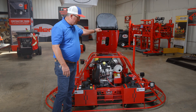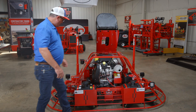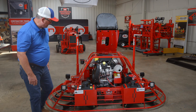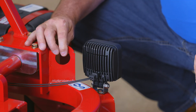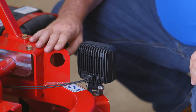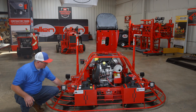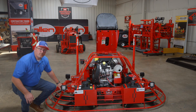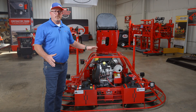As we go into the future, you're going to see a lot more of these machines out in the field. They're easy to use, easy to operate — it's a simple machine. Make sure when you lift this machine, you use a four-point sling and hook up to these. Grease the thrust bearings daily — there are decals all around this machine to keep you up to date on that, and if you lose them, replace them. It's important so the next owner can keep up with it.